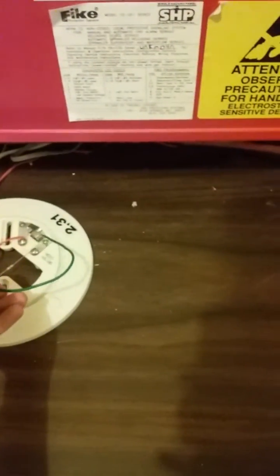This strobe up there is now flashing and the NS is pulsing. Zone one alarm on the 4001. Now let's activate second stage. I don't have a heat source with me, so I'm going to have to activate the smoke detector manually. Now, the SHP is now pulsing, and this can't be silenced. It is now counting down to a release.